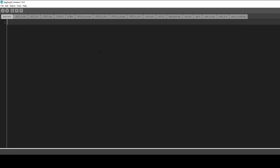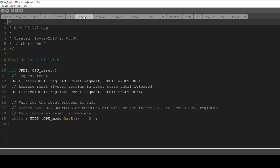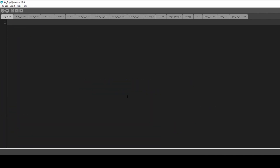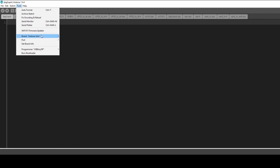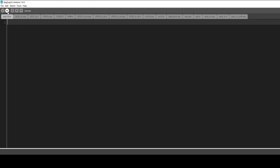The sketch itself is empty and that is no problem at all, because everything we need is in all the other files, and the advantage is we don't have to change anything. The only thing we have to do is make sure we've selected our board — the Arduino Uno — and selected the programmer to be the USB tiny ISP.